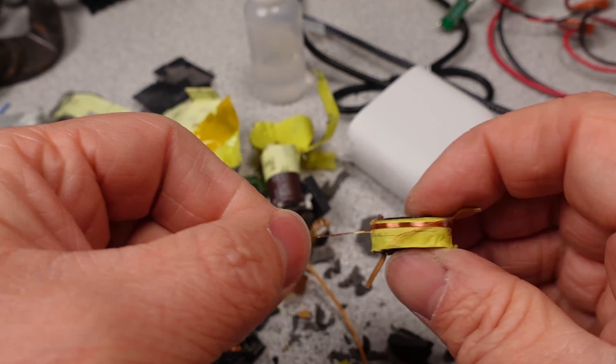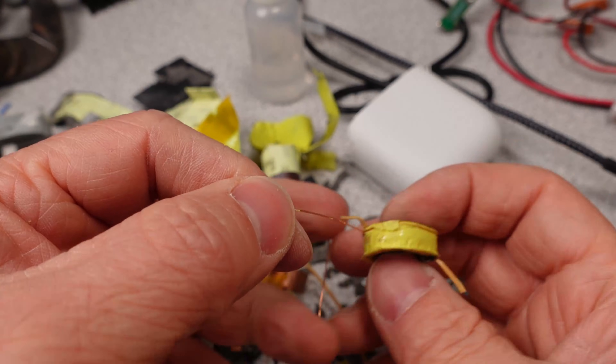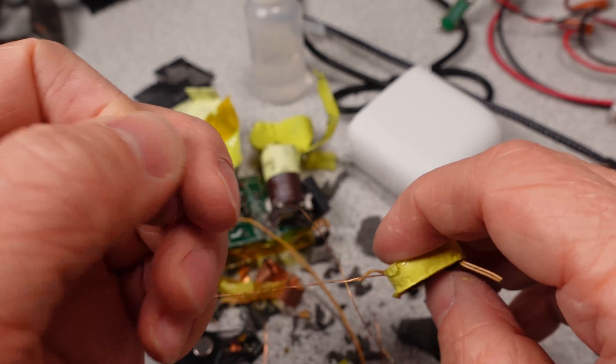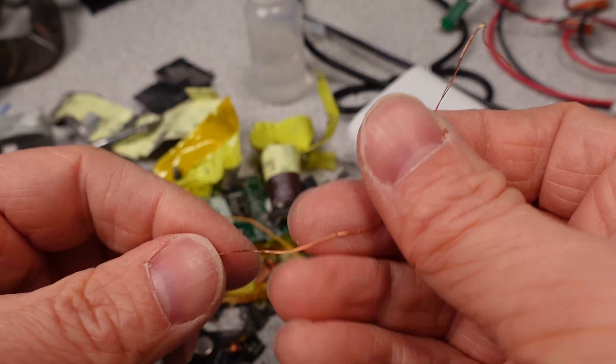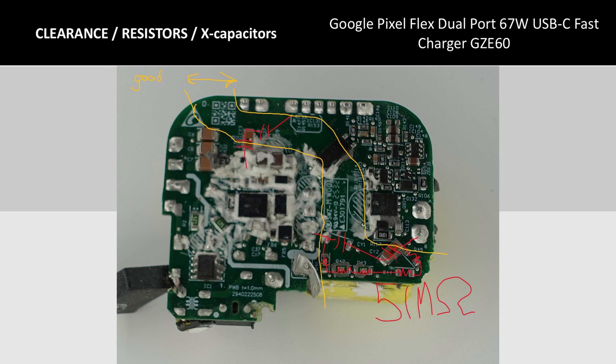The adapter uses mostly branded components that I was able to get datasheets for or at least find their existence online, so that's not bad. Some of the components are a bit cheap — notably the capacitors are Capxon, which is okay. They are cheap, but they are fine. It does get very hot inside this adapter, so the lifespan is always a concern, but there is so much buffer in that primary capacitor, I'd expect a very long life out of it, even if it is hot. The auxiliary capacitor is ceramic, so the part that will dry out first will never dry out. The indication of this drying out is when the power supply hiccups, but it's going to take a very long time to see that, and that will be if this is under very stressful conditions. The unique features are the Gansense integrated circuit, the dual bridge rectifiers, the link of resistors adding a DC component to the leakage, and the collection of four capacitors for the EMI control, along with the shielded and very complex wound transformer.